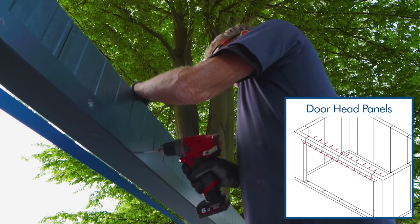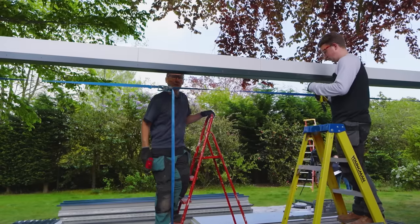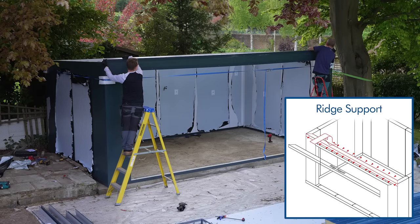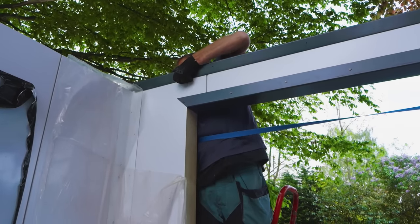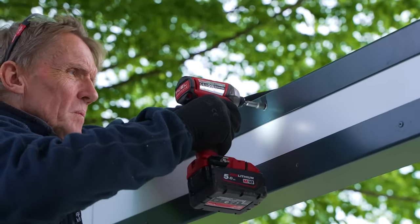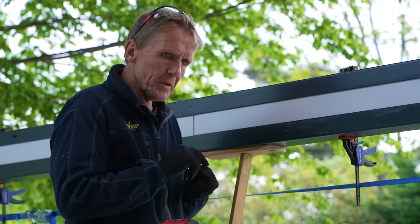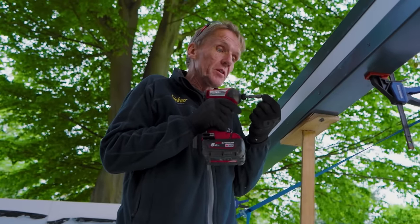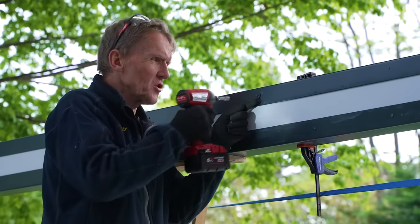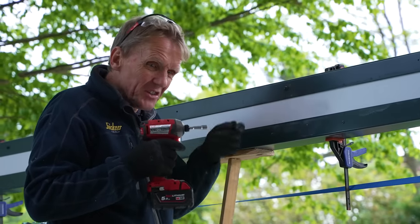The head infill is drilled and riveted. The ridge beam is a heavier section because it's load-bearing, and it's also a pretty tight fit, so you just need to ease it in and push it down. The screws are self-drilling tech screws with a rubber washer head. If you over-tighten them, it squashes the washer out and they don't do anything. The trick is: as soon as it goes through, stop — then just give it a tiny little tighten. Just squashes that washer but doesn't squash it out.